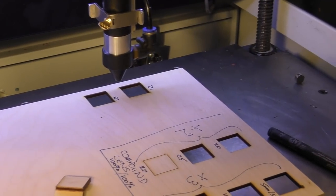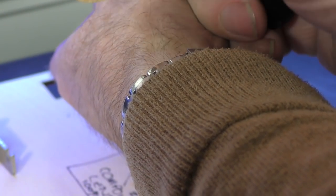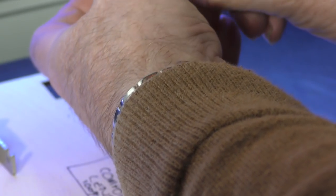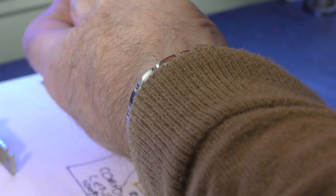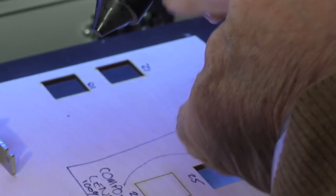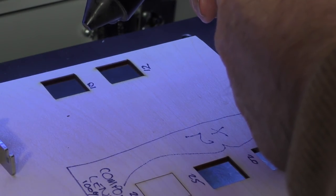It's probably only delivering about 50 or 60 litres a minute. I've already got the focus set, 7 millimetres. I'm now going to push the nozzle down by the thickness of that washer, which I've made out of 3 millimetre MDF. So I'll put that over the collar, over the thread there, and I'll put the lens tube back on. So now I've increased the distance between the nozzle and the lens.